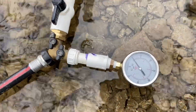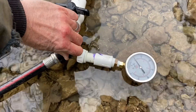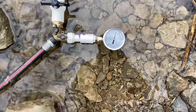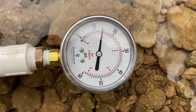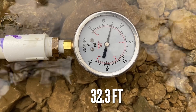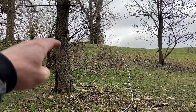Let's take the pressure gauge down. We're down here at the pump. I got the pressure gauge put on. We're going to valve off the pump side and then open this to the line coming in — the line coming down the hill. So I've isolated that line and we're just measuring head pressure. It looks like right on 14 PSI. 14 times 2.31 is 32.3 feet — a little over 32 feet high that we're pumping up into those elevated tanks. I'm geeking out on this.